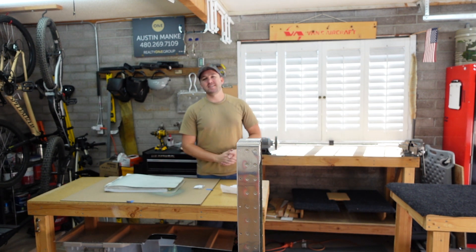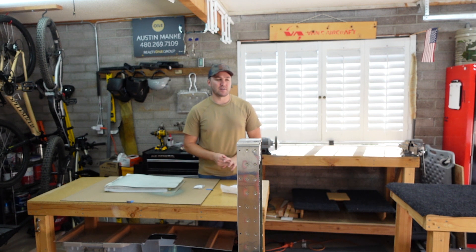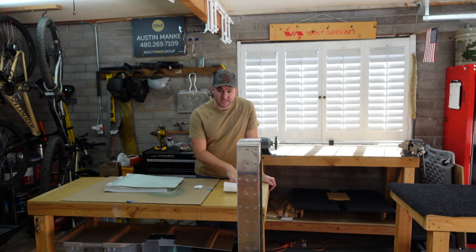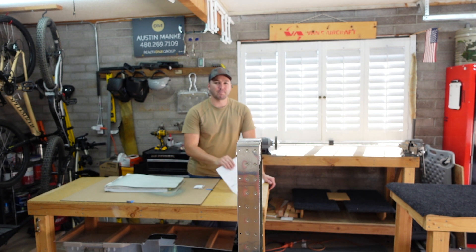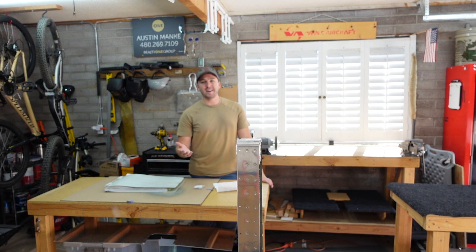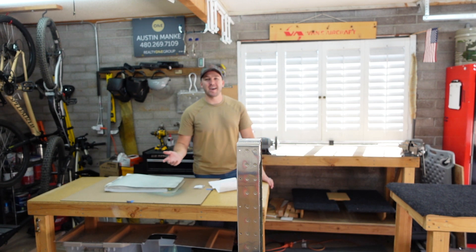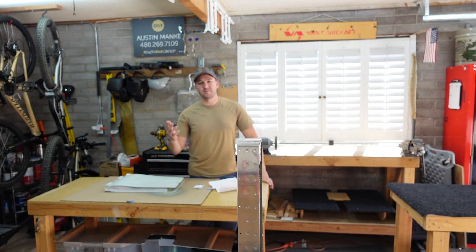You're never going to see it. I dug out as much as I could and I'm happy with how it turned out. The only gotcha with the service bulletin: inventory your kit. I was about six rivets short on the AD41ABS rivet — those are the pop rivets that close out the leading edge. Luckily I had already purchased another 50 of those just to have on hand. The other one I missed was LP4-3 — should have had four of those rivets and I had none. Luckily I had extras from a previous order. So just inventory your kit well or order some extra rivets.